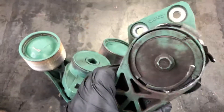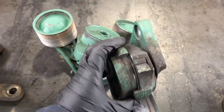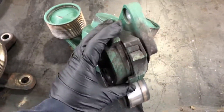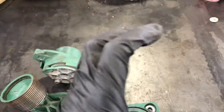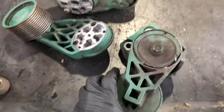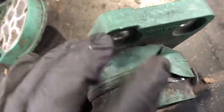As you can see, this one looks really rusty and it's already broken. This tensioner has been in service a long time — sometimes we change them with more than 400,000 to 500,000 miles on them. All this rust is from the grinding with the movement they do when the engine is idling. If you can spot something like this on your tensioner, it means you need to be replacing it.